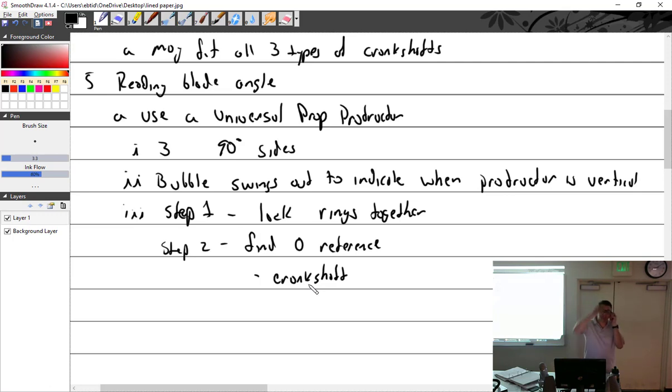If it's a spline shaft, use the top of the splines. Don't use the front circle — it's a small circle. Don't use the spine of the crankcase; that's got rough machining, bolts that could be a little higher or lower — that's really bad. The undisputed zero reference is the crankshaft itself.